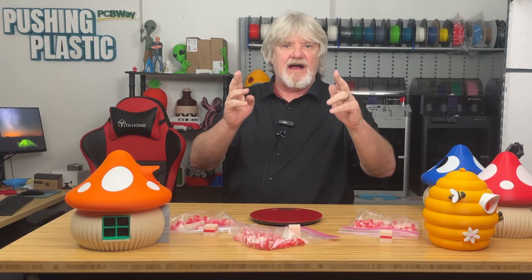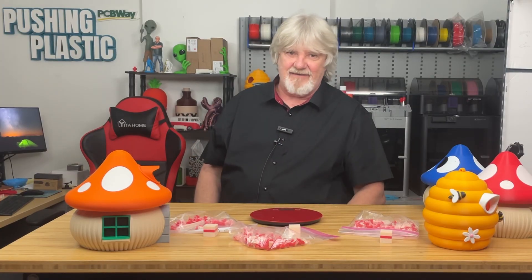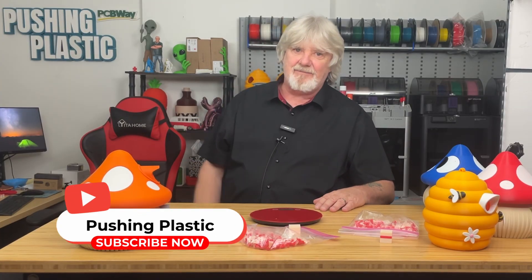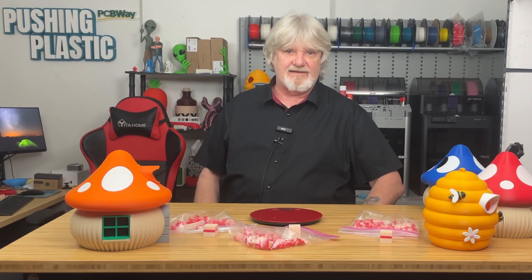That's all there is to it — give it a try, find out what works best for your printer and slicer. Don't be afraid to experiment with the settings. It's all about reducing waste and print time while delivering a great-looking model. Remember: the lower the number in your flushing volume, the less material you'll use but you risk bleed. The higher the number, the more material you use but you're pretty much guaranteed a clean print. Find that fine balance. I hope you found this useful — hit that like button, comment below, smash that bell, and please subscribe.